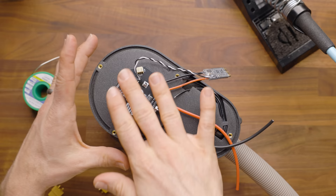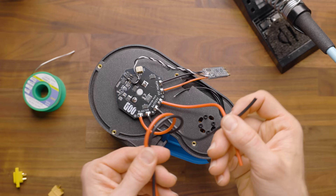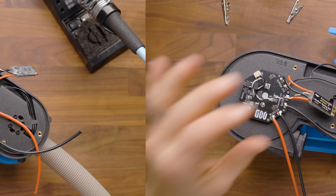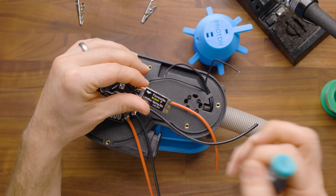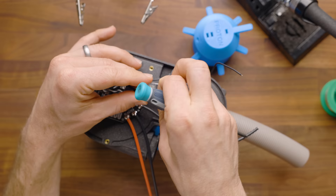At that point, we are actually done with the soldering on the PCB itself. We're going to move on to the connectors — the two XT60 connectors — and we'll connect the brushless motors here to the ESC. Next, we're going to wire up our ESC, and this requires a little bit of organization because there are three wires that come out of the three-phase ESC and they're going to connect to these three here.